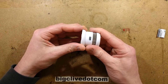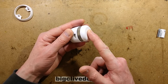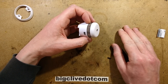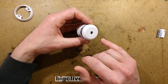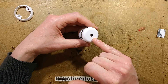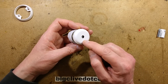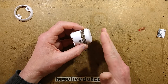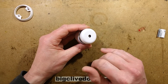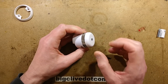Now it will lock into the base. I'm going to make this sound — it makes a sort of sweeping siren noise, so I'll put my finger over the end to reduce the volume. This unit, instead of just going beep-beep-beep like most smoke detectors, does a sweeping noise. I wonder if that's to keep the circuitry simpler for the sounder, because by sweeping under the control chip's control they allow for manufacturing tolerance of the acoustic cavity. It may also be so they hit the resonant frequency of the chamber, resulting in peak sound output.